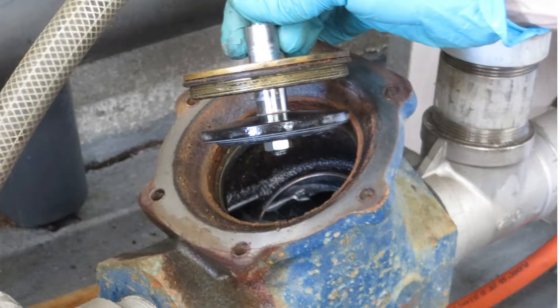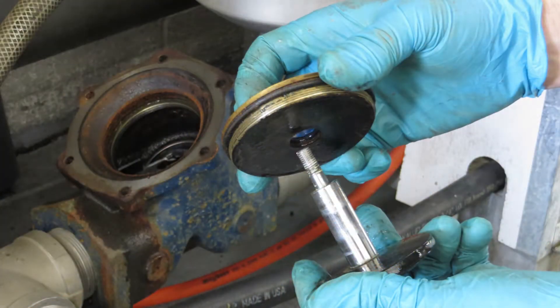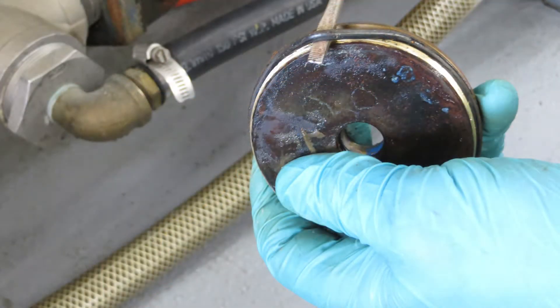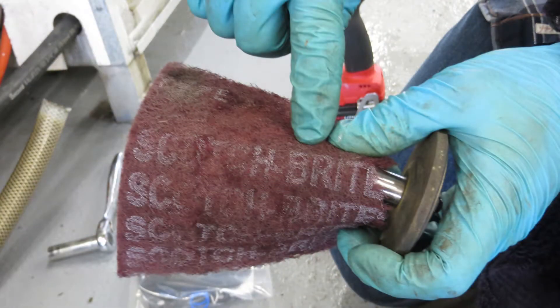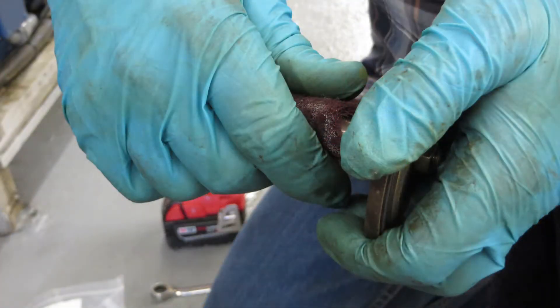When it spins free, remove the nut plate and pull the shaft out from the bottom. Remove the original o-ring from the nut plate with your screwdriver. Now it's a good time to burnish the shaft so that it moves up and down on the nut plate smoothly. You'll see that it's kind of worn and not quite smooth, but I like to use red scotch-brite pads for polishing up the stainless steel. Wrap it around the shaft and spin the shaft back and forth about a hundred times.